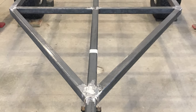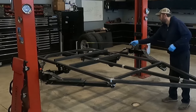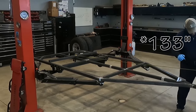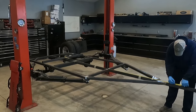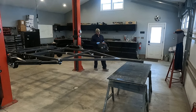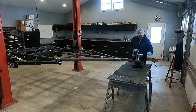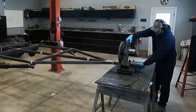If you remember from the first video, I kept the center spine of the trailer pretty long, because I wasn't sure on the exact wheelbase I wanted. I finally decided I'm going about 130 inches for the wheelbase — somewhere in between what's ideal for a third gen Tacoma or a Jeep Gladiator. I used a scrap piece of metal over the exact center of the axle line, then I measured out onto the neck of where I should be cutting, and used the chop saw to get a nice square cut.